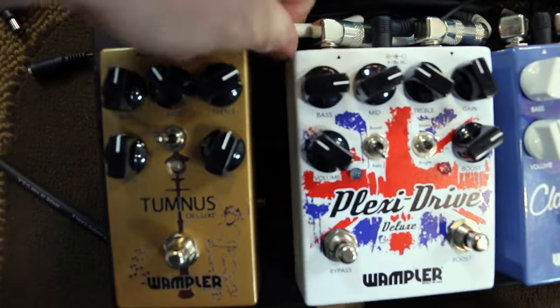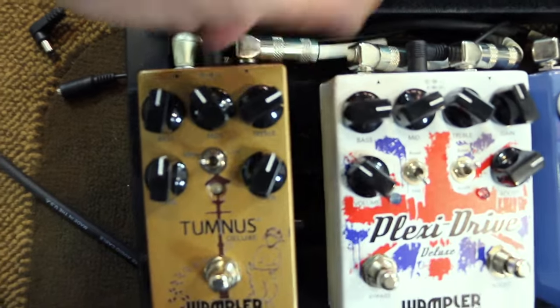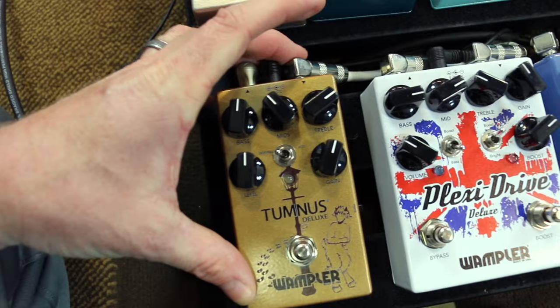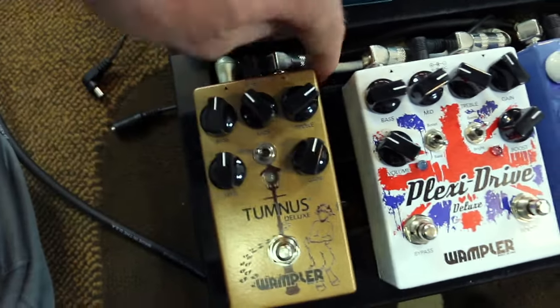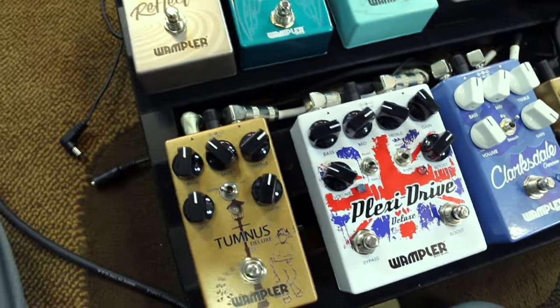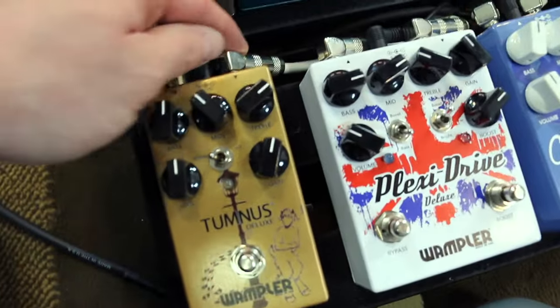So let's say that you have done all that, but you still find that it's making noise. Let's say there's noise whenever you are messing with the jacks. If you wiggle like this, and it's making noise, mostly when the pedal's on, but not necessarily, even when the pedal's off. And let's assume that whenever you take that cable out and use the guitar to plug it into your amplifier, it doesn't do it then. It's only when you put it in the pedal.